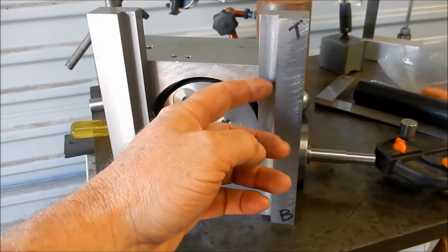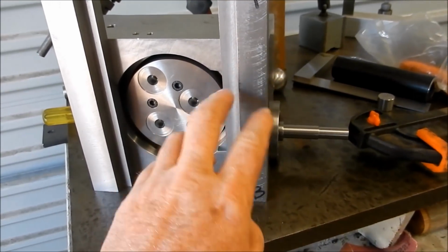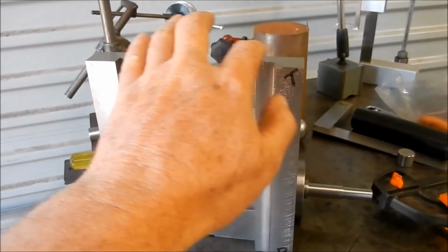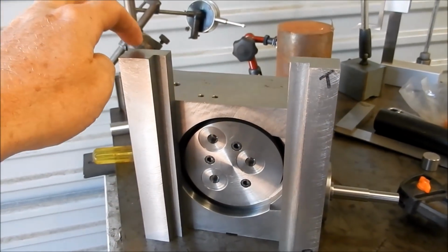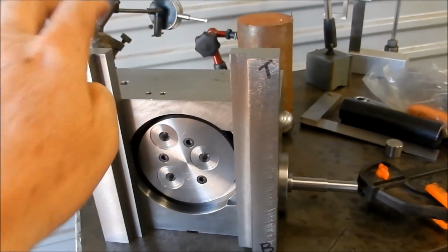So obviously we've got a fair bit of work to cut with the dovetails. We've got to do our drilling and counter boring to be able to mount our socketed cap screws in place, and then we've got the bridge that's got to go over the top. So I've got some drilling and tapping to do in these, so 3 in each.